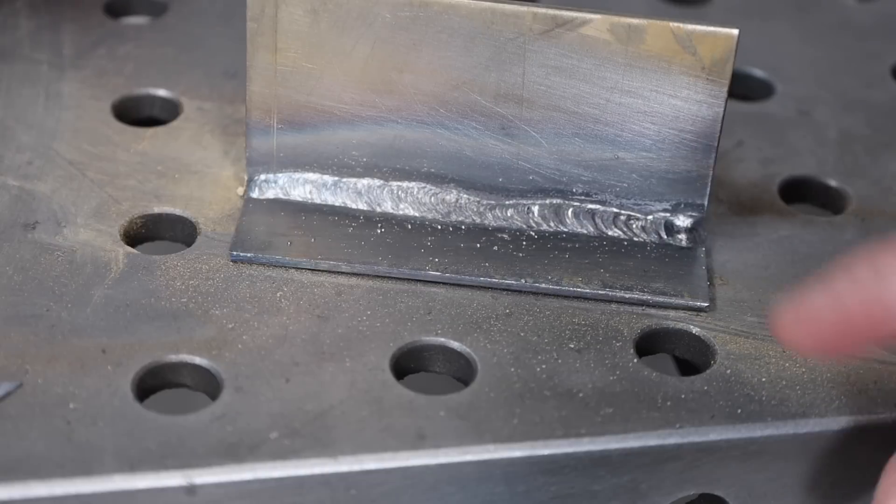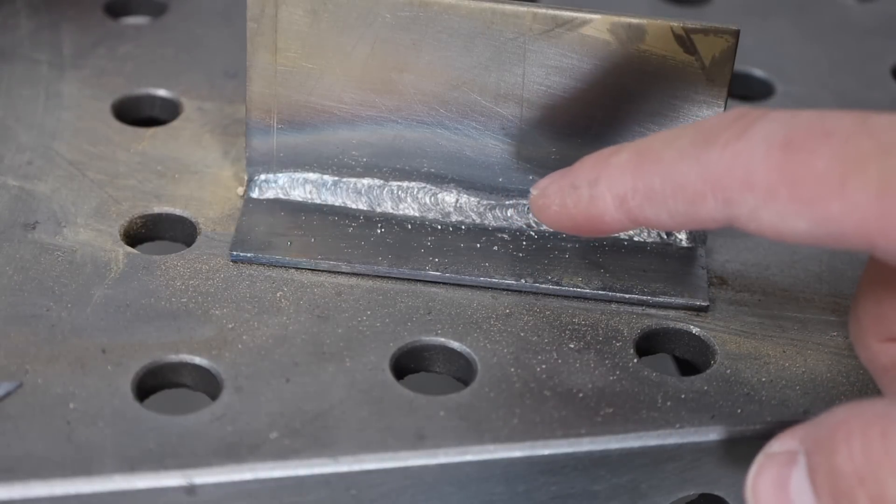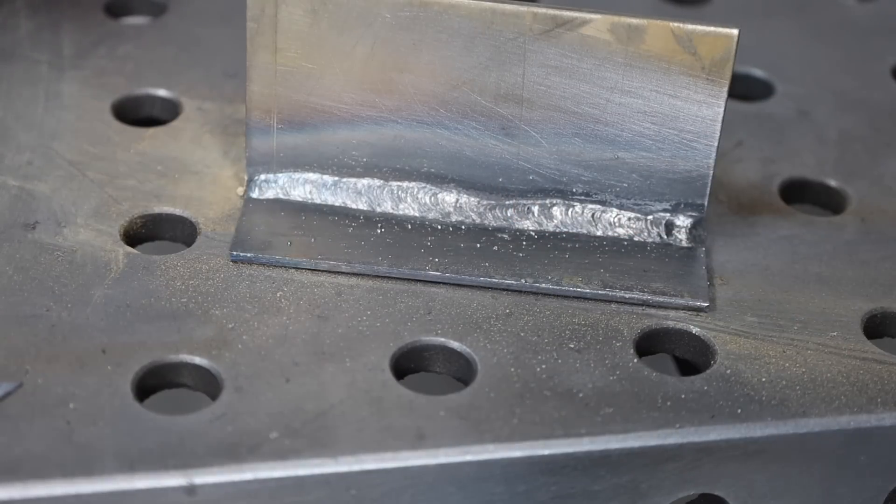Once you're able to see the weld puddle, you can start to tailor the size of your weld by controlling your travel speed. The slower you travel, the larger your weld will be because you're depositing more metal in each location. If you look at the low spot in our better example right here in the middle, the reason this happens is that I sped up a little bit at that point. On your next welds, pay attention to your travel speed as you work your way along — watch that weld puddle and size your weld by adjusting how fast you travel. If you're just getting started with flux core welding, I'll link a full tutorial video down in the description, and I'll also put a link to my online courses. Until next time, weld safe and we'll see you then.